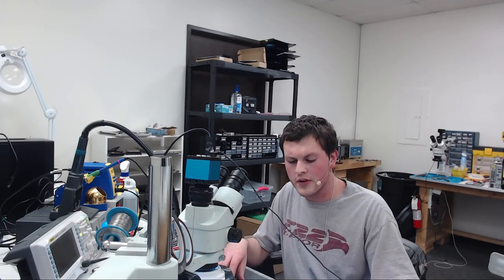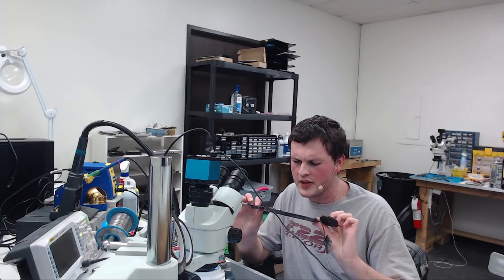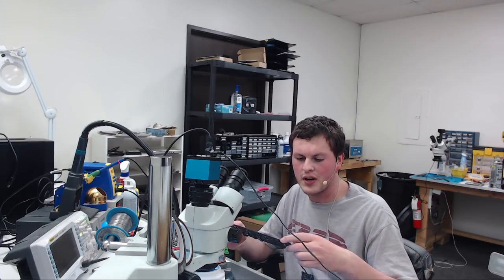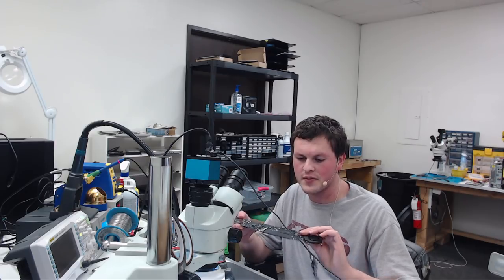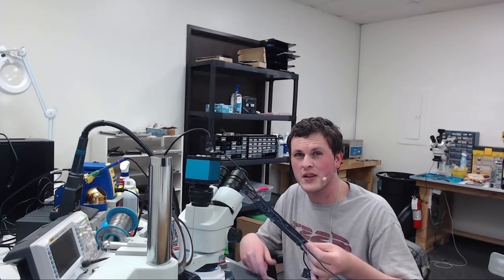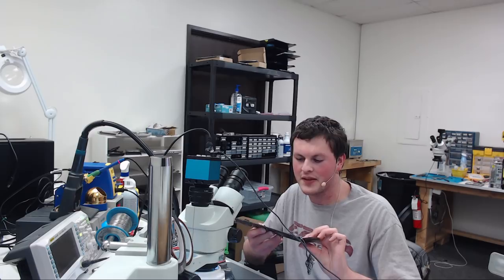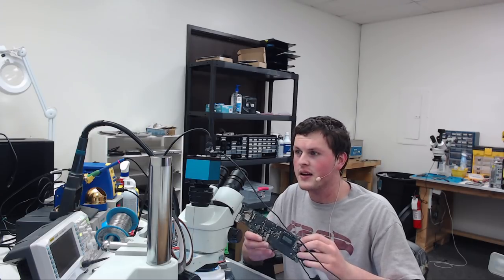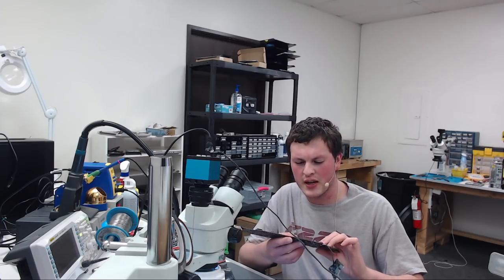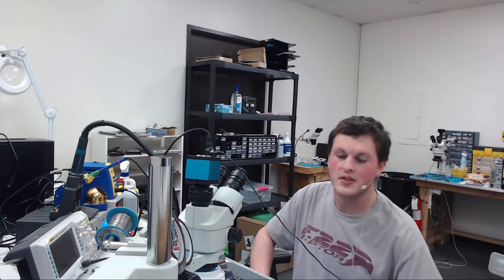Hi everyone, so earlier today I did a live stream on this 820-0165. The issue with this, it had a charging issue and then had an SMC reset issue, and after we fixed that, we plugged it in, the fan spins fast right away and we get no CPU vCore, no ALL_SYS_PWRGD, no PM_PCH_PWROK, things like that. So I ultrasonic'd the board because it had some junk under the CPU, and after I did that, it still was dead. It still displayed the same symptoms.